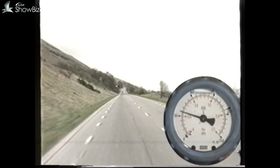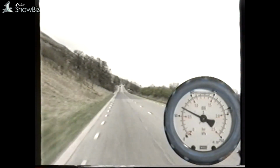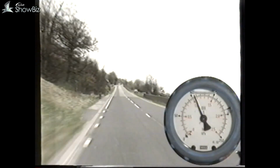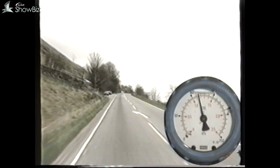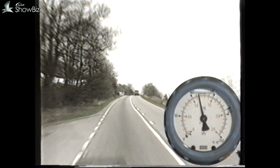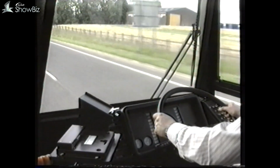When the engine speed passes through 2,200 RPM, the pressure reading should be recorded. This test should be repeated a number of times and then take the average reading. For guidance, the reading should be in the order of 1.3 bar if the turbocharger is performing correctly.